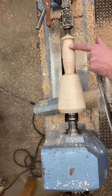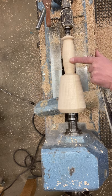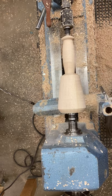He's like, because you're getting such a clean cut, the back of the tool is actually burnishing the wood. It's closing that grain. Then you're just taking 220 sandpaper, running it over the top of it, and it's not opening that grain back up. So no matter what I am working on, I generally will always go back and start with 150 grit, because that opens up the grain for me. I know that it will evenly accept finish, and I won't end up with any cloudy or blotchy spots. So that's part one about sanding.